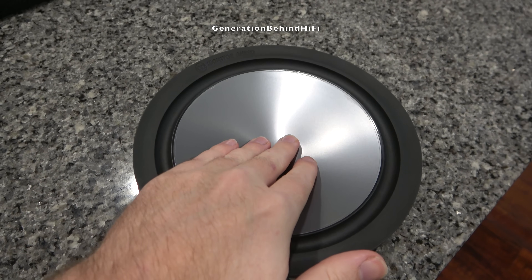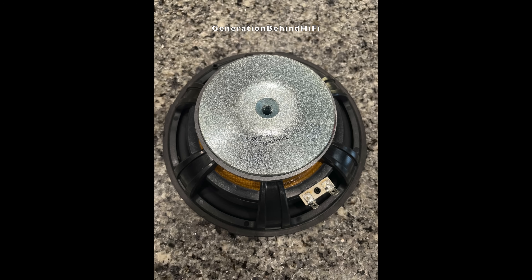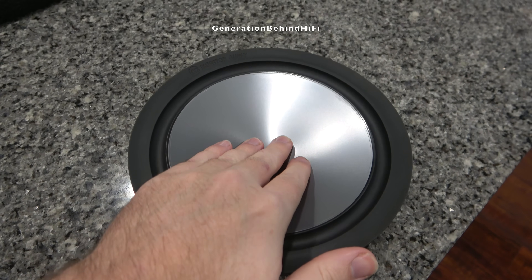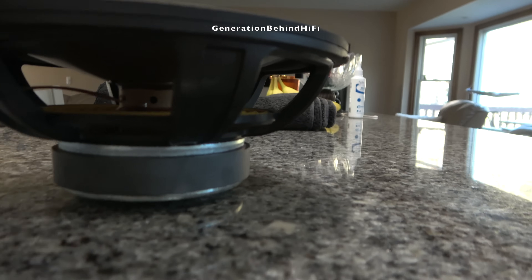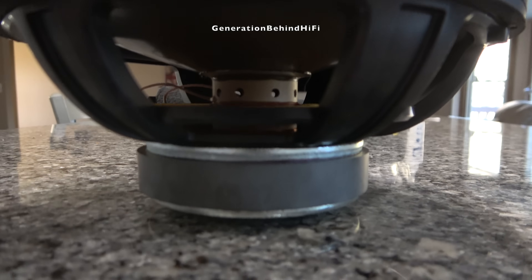As for the anatomy of the mid-bass driver, it appears to use a 2-inch overhung voice coil and the former appears to be made from paper. Both the lead wires and voice coil are made from copper instead of copper-clad aluminum, which is refreshing to see. Monitor Audio is also using a vented bobbin so trapped air has a place to vent during long strokes. It now makes sense why Monitor Audio is using a long threaded rod to mount the speaker from the rear baffle — primarily to add additional support for the plastic composite basket so it doesn't crack or break during shipping.